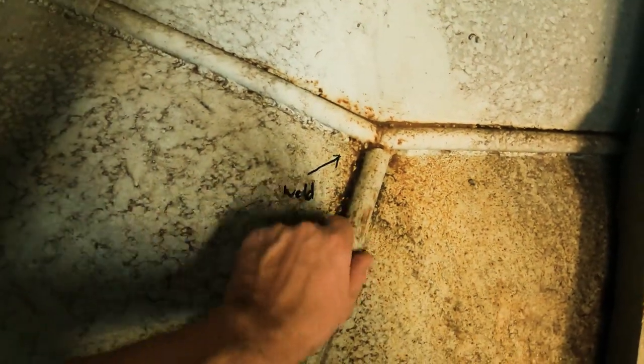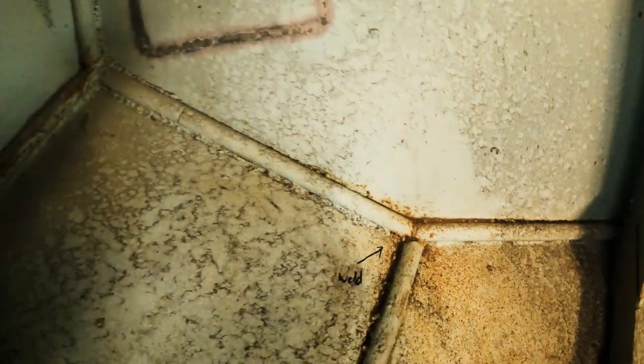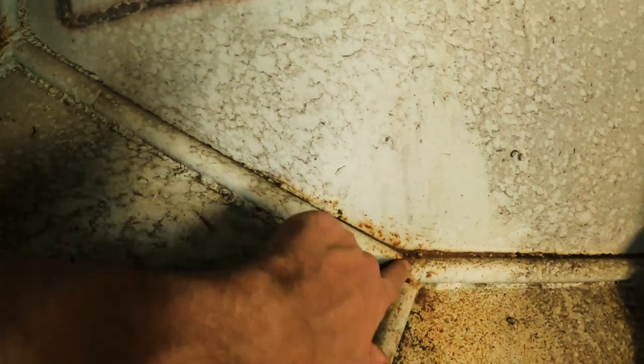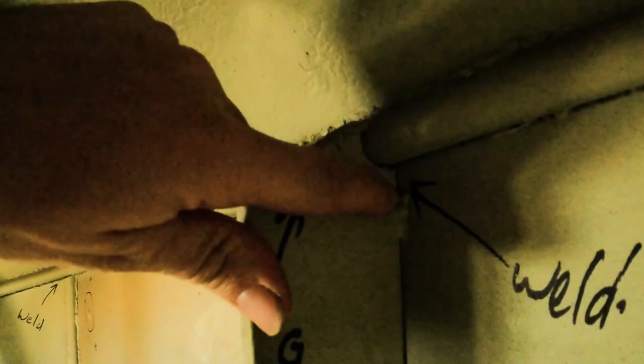These are solid steel bars that run along all the weld joints. They're not welded together completely. This one is welded in all three axes, but this one is welded on that axis with no weld joining them on the other axis, so I'm going to weld all that up. Same as these webs - I'm going to weld them up. You can see up here it's been ground away but there's no weld, so I'm going to weld that up. I want to grind these plaques because they've just been cut with an oxy torch - I want to grind them so they're nice and neat. Got these bits of arc strikes too and I'm going to get rid of them.